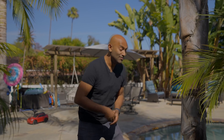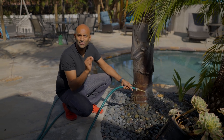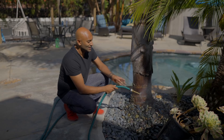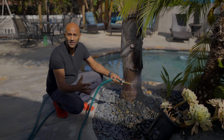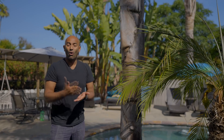The first step to this mission is monitoring and understanding just how much you use. And it turns out my house is leaking 0.28 gallons a minute, every minute, every day. It might not seem like all that much — if I put this into a five gallon bucket, it would take about 17 minutes to fill up. But every minute all day translates to about 400 gallons, which is a huge amount.